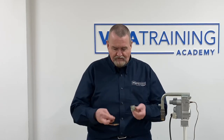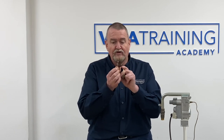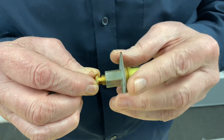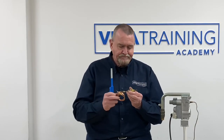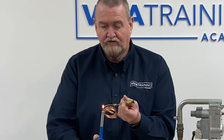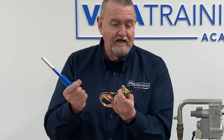The first way is using my little test rig. I've got a thermocouple here I want to test, so I tighten it into the thread on my test rig. The thread on that nut is too small to screw in, so I'm using a sliced nut — a nut with a groove cut out — which fits over the lead on the thermocouple. It only needs to be hand tight. Then I've got my little hog lighter. I'm pushing that in with my thumb, lighting it, and putting the flame under there for about 10-15 seconds. When I release, it's holding. If I turn the flame off, it's still holding — it should hold for about 15-20 seconds. Once it's de-energised, the spring overcomes that and it will pop out.